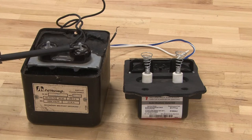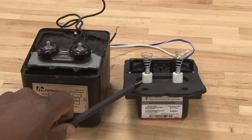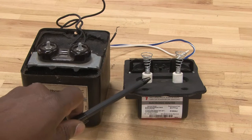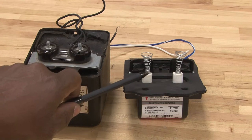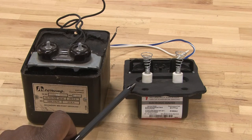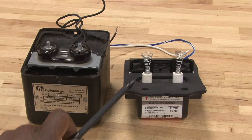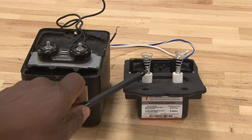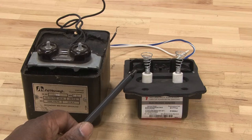These are the electrodes. These will be connected to a bar which connects to the electrodes and the rods inside of the burner assembly. The newer type of electronic ignitions will be this type. Most systems will have this type — it's very efficient and takes up a lot less energy to operate. Most common oil furnaces manufactured today would have this type of electronic ignition module.